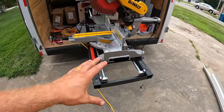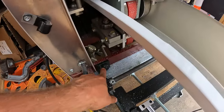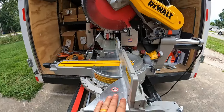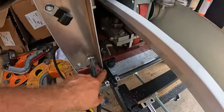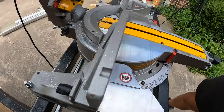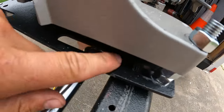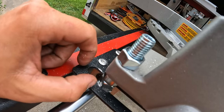But while you have your gutter miter station on the blocks and before you start working on installing your L brackets, you need to make sure that your gutter is gonna run out on this miter saw perfectly. You have to be very tedious when installing these L brackets. You need roughly 1/8 inch between the back of the gutter and this fence. You also have these mounting plates for the miter saw with these slides on them. You can see I have an additional 1/2 inch to move in the front.